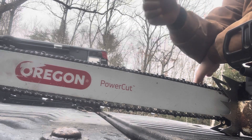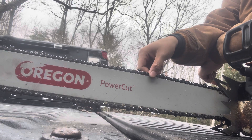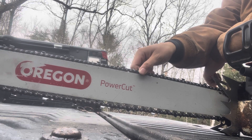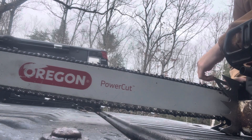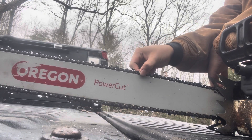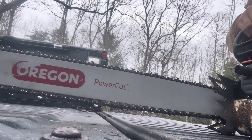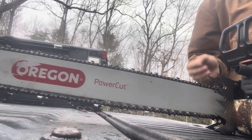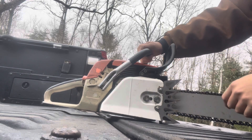The reason I store it like this is because in the cold, it's really bad. If I tighten this chain to the point where I normally run it for slashing — which is relatively tight — and then let the saw cool down, especially in the winter around here, the chain will get so tight that I run the risk of breaking the actual crankshaft on the clutch side. It allows the chain to contract without tightening up against the bar and putting excess strain onto the clutch pack and the internals of the saw.